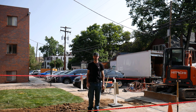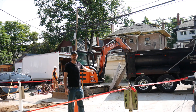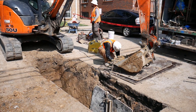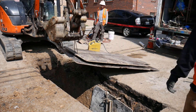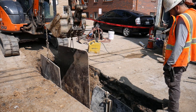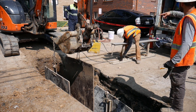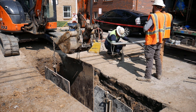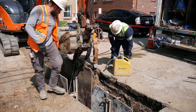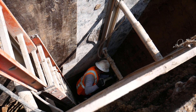And then we've got a brand new sewer line that should hold up for a long, long time. You can see behind me, we've finished the excavation for that city tap and we're tying that in. We're setting some stress points here to keep the soil from compacting and collapsing on the guys as they're working. Those forms hold everything up and give a solid working area to finish that tie-in to the city. Then we're just going to set our rock, wait for the inspector to show up, get a thumbs up, bury that, and from there it's just patching everything up and we're out of here.